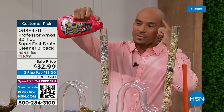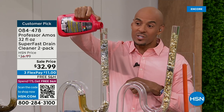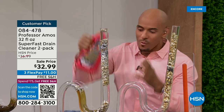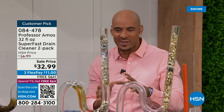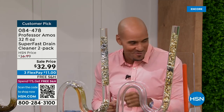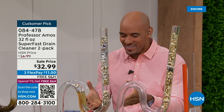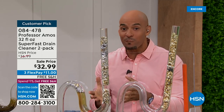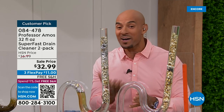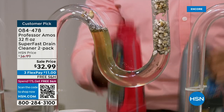The other thing I want you to think about, they tell you to pour half this bottle right down the drain. Well, that's a lot of chemicals that you're pouring down the drain line. Now take a good close look at what's happening. 90% of the chemicals trickle, ooze, and creep right past the clog, and it all ends up down here at that curve unit. This curve unit is designed to hold fluids to keep odors from coming back up and permeating through your house. The chemicals are sitting there building heats of up to 180 degrees Fahrenheit.